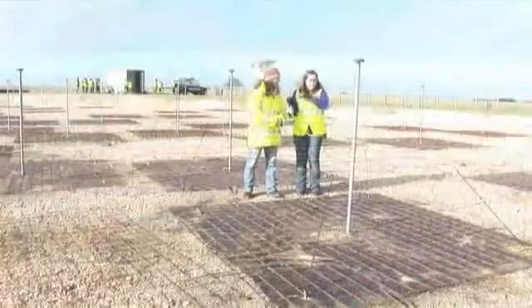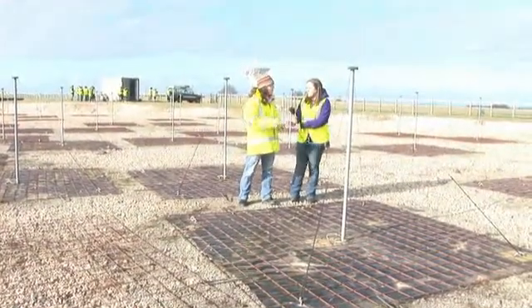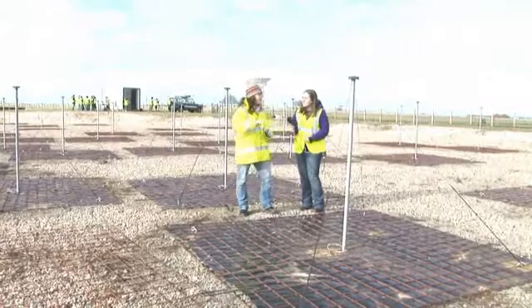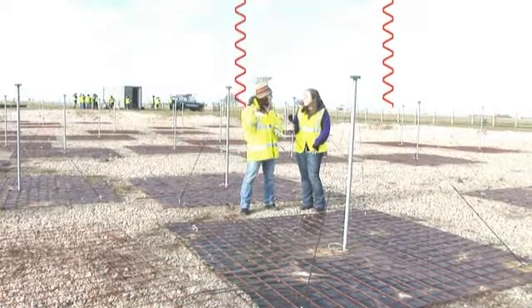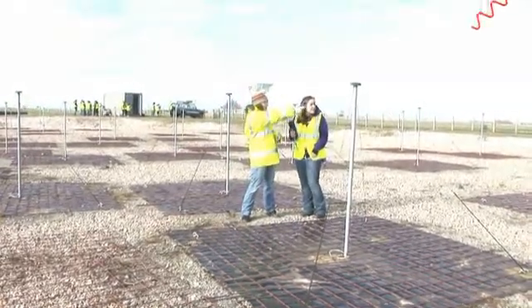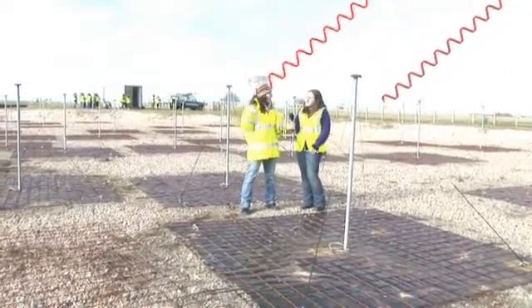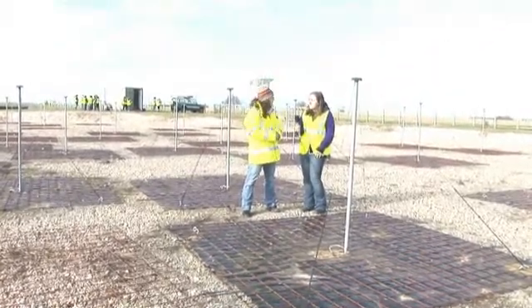Given that all of these are anchored to the ground, how do you actually point it at something in the sky? It's all done electronically, by adding in little time delays between the antennas when we add up the signal from each of them. If you imagine looking at something straight up, the radio waves would hit each of the antennas at exactly the same time, so you wouldn't need a time delay. But if you wanted to look at something on the horizon, the radio waves would hit the antennas on this side just slightly before the ones on the other side. You add in this little time delay and that allows you to point — it's all electronics, all done with computers.